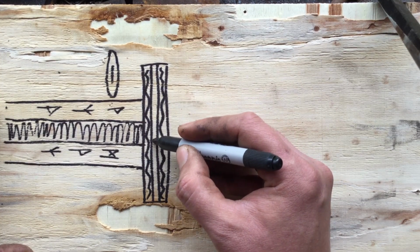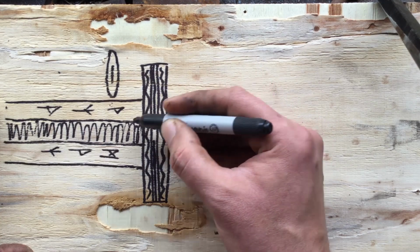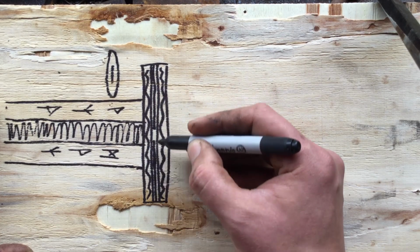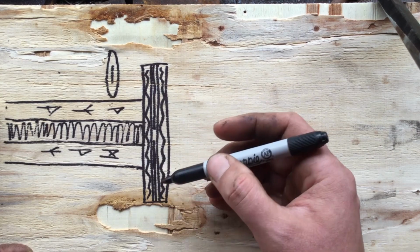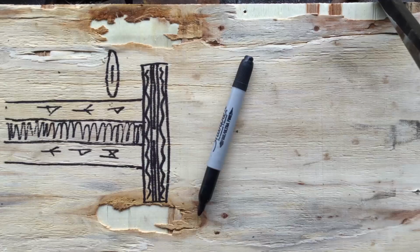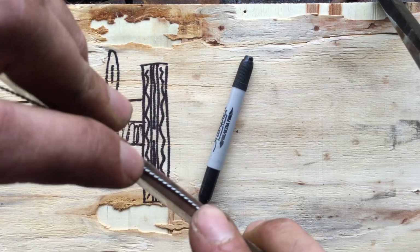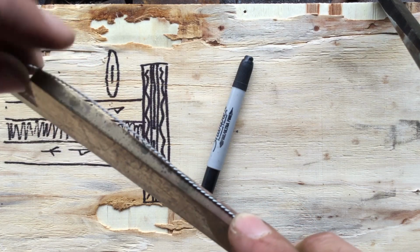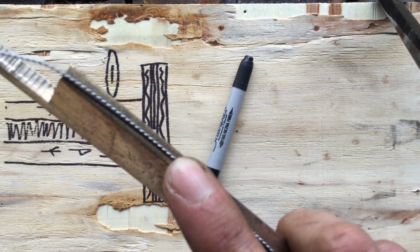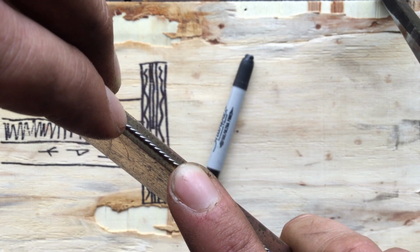And the brass is going to have a channel cut into it that starts at the fuller, runs around to the back and stops at the fuller, and this one here is going to start here at this side of the fuller and go round and end up at the back. And inlaid into this channel is going to be some twisted wire. So if you can kind of imagine it with these rougher materials, there'll be a layer of brass with twisted wire inlay. Of course, that will be polished brass, but silver wire on brass. There we go. But actually inlaid into a channel all the way around the brass.